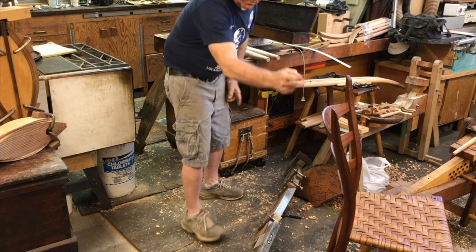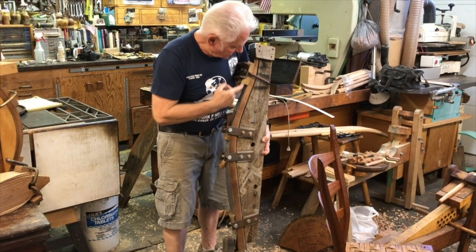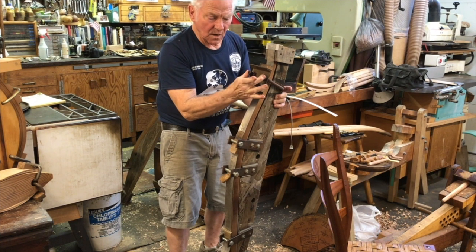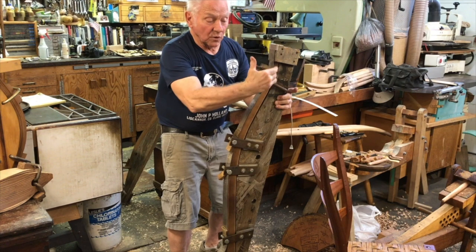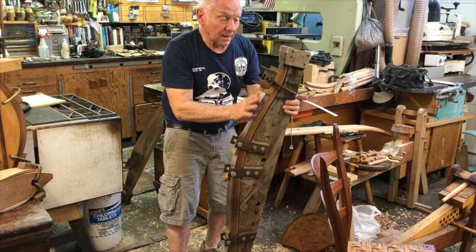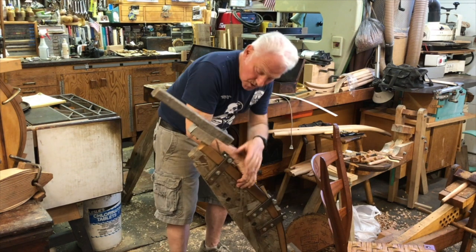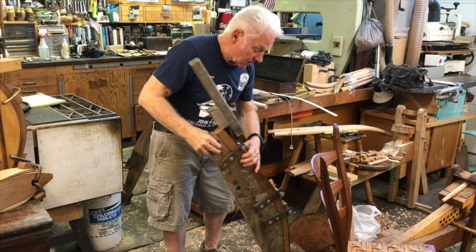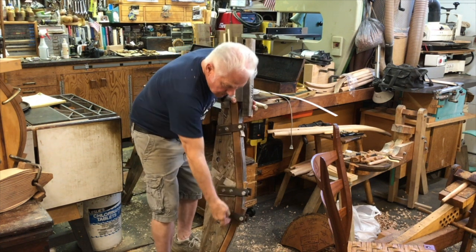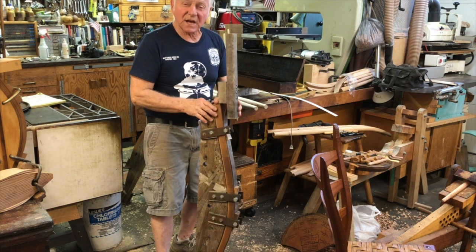And the bending form to create that top bend requires a bit of a different type of clamping process. I use this channel iron with a trailer leaf spring U-bolt and a block of wood that matches the curve that I want the top of this leg to be. It has a stainless steel strap here that keeps any metal from touching that wood and spoiling the color. Plus, the stainless steel allows me to attach a handle here to give me leverage to make this bend, and then start putting in bolts and driving in wedges as I'm making this bend. So again, it's quite simple, and it doesn't tie up all of my shop clamps.